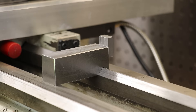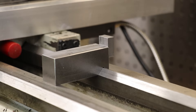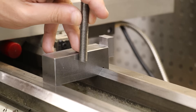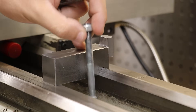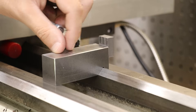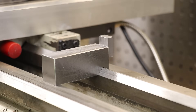The next thing that needs to be addressed is how do I hold the standoffs in place. Like the tailstock, it needs some sort of clamping plate on the bottom. The most simple solution would be to drill all the way through and then stick a bolt in it, which is pretty much how they do it for the steady rest. However, I can't do that because I still need a drilled and tapped hole for holding the dividing head in place. And those things are going to be pretty much in the exact same spot. So it's at this point where my very simple, very straightforward one-afternoon project became a lot more complicated than I initially was hoping for.